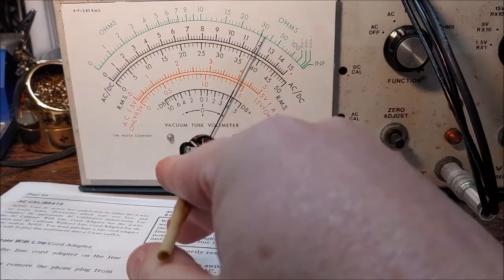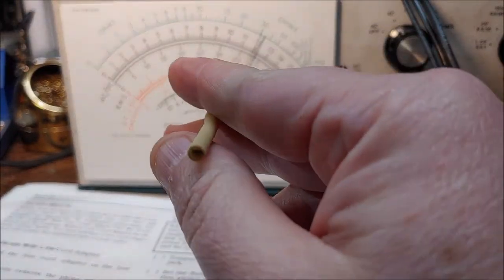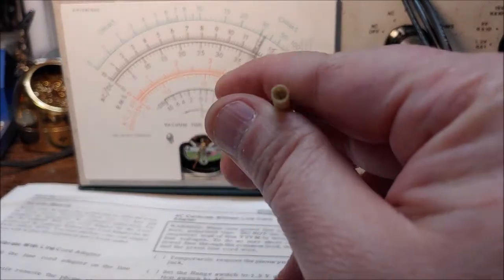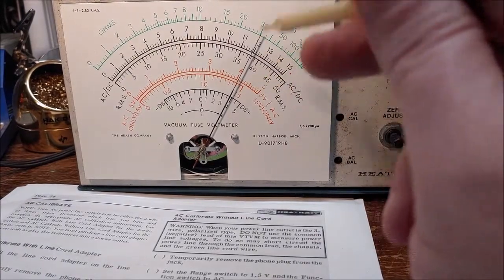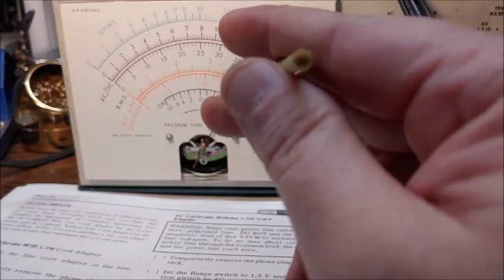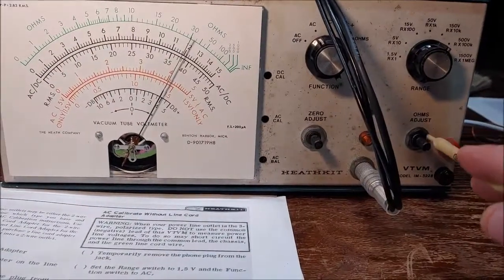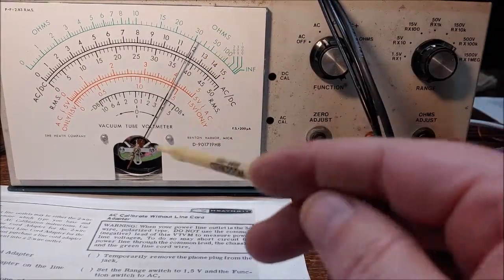So you're going to do your mechanical zero first without it being powered on, without a jack in it. Then you're going to do the zero adjust, and that's with the power on, and after it's warmed up for a while, and no jack in. And then you're going to do the DC plus calibration, and that's with the jack in and a known DC source using your DC probe. In this case, the red probe. And then you're going to do the ohms adjust, and that's going to be this knob right here. Remember, we didn't do that because we're going to do that in the next video when we do the battery eliminator circuit. And then you're going to do the AC calibration.